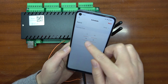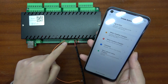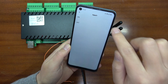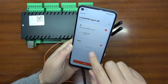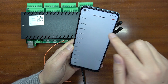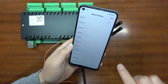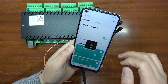Now I will show you how to use the input state to trigger the relay output. Click to create a new scene. Set the condition: if H32P Pro input 1 becomes on, then run the device — let relay 1 turn on. You can choose switch 1, and set it to on, off, or reverse. Reverse means on becomes off and off becomes on. I select on, then save, click next, save, and enable it.